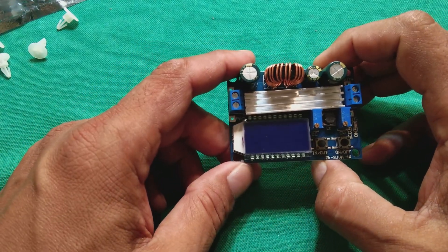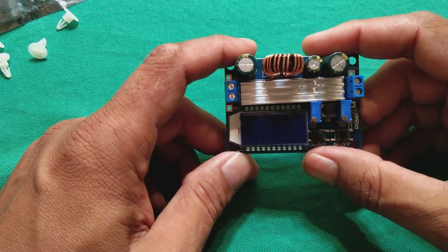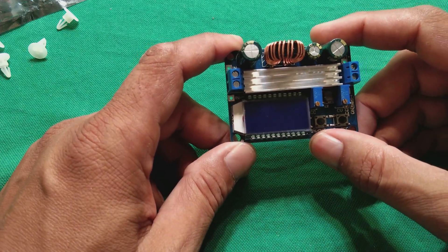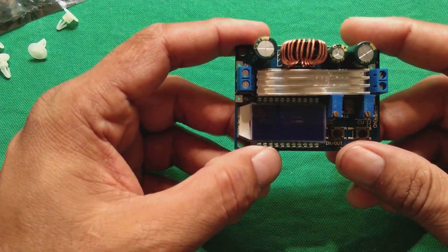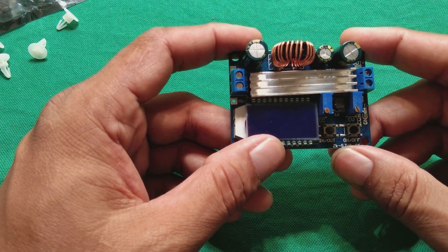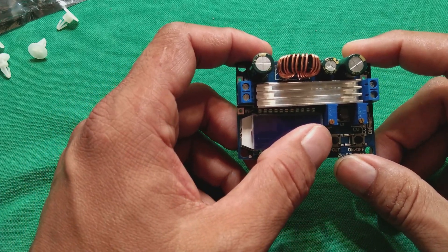If it is required you will put it, otherwise you will not. This module handles 3 to 4 ampere — 3 ampere is very stable and 4 ampere you can even use — and some 30 to 50 watts this module can bear. So for most applications this small module is useful. You can use it as an adjustable voltage power supply.